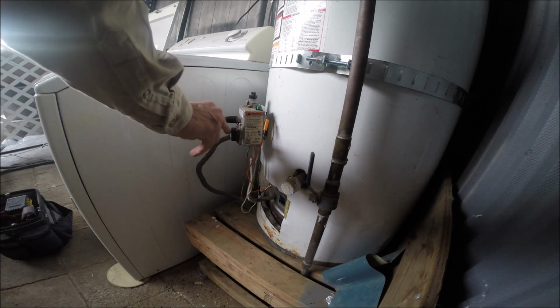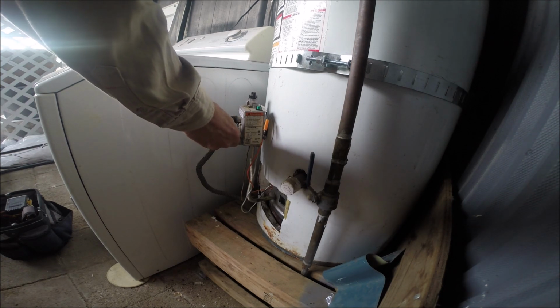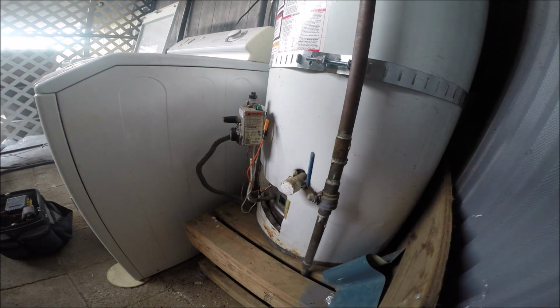So I'm going to put you back down between A and B. That's a pretty good temperature. If it's not hot enough, maybe this winter, you can crank it up a little more. I leave mine at B, but you were at beyond C, which is like 165, 170 degrees. You can hurt yourself with that kind of water.